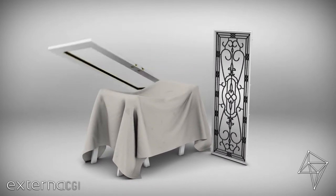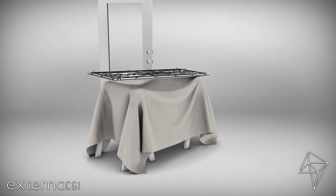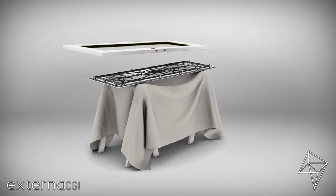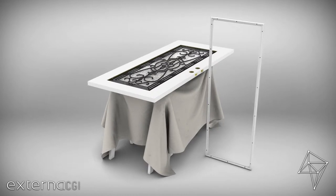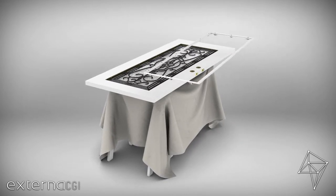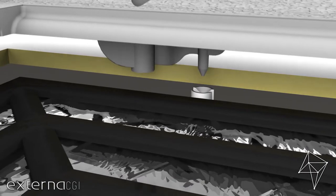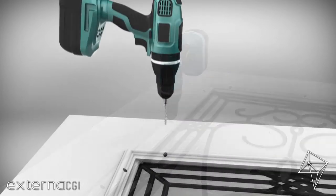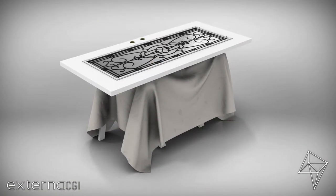Lift the door off of the sawhorses and lay the outside door glass frame out over the sawhorses. To ensure the glass is correctly installed, the temper stamp should appear on the bottom of the door. Carefully lay the door over the door glass. To properly distribute the weight, place the bottom edge of the door opening snugly to the bottom of the door glass. Place the interior frame with exposed screw holes over the inside of your door. Align the frames by matching the screw hole guides. Insert each screw working from side to side, tightening firmly so that the frame fits snugly against the door and the seal is compressed. However, avoid over-tightening the screws.